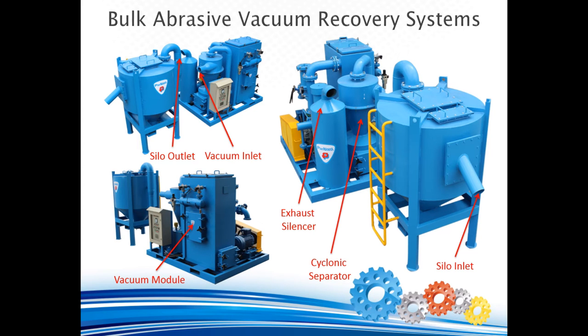The vacuum suction hose is normally connected to the silo inlet to feed recovered spent abrasive media and removed contaminants, which are stored in the storage silo. This vacuum suction is generated by the vacuum module, which is connected to the storage silo at the vacuum inlet and the storage silo outlet. Clean exhaust vacuum air is discharged to atmosphere via the exhaust silencer outlet after passing through cyclonic separation of abrasive and contaminant fines from clean air.